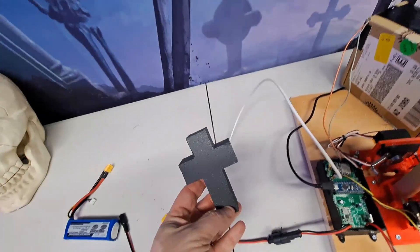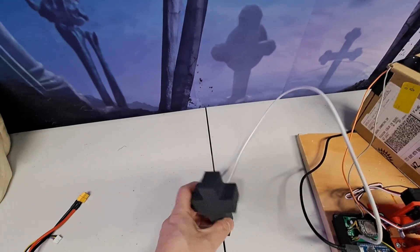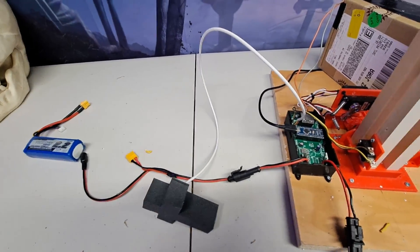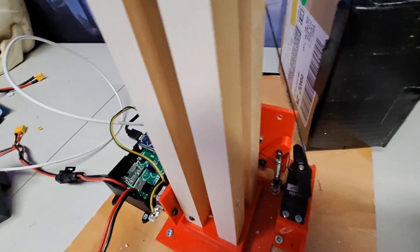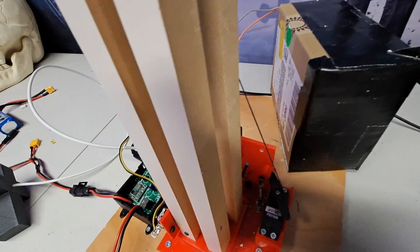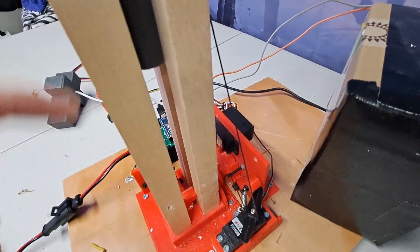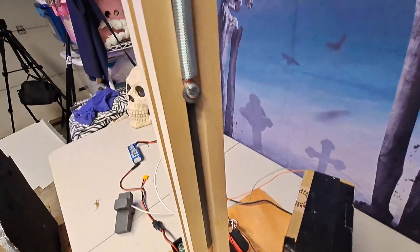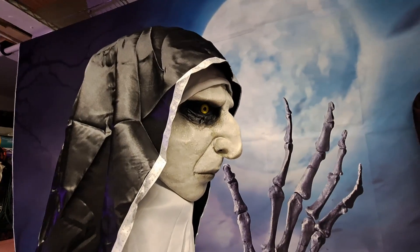I have a trigger housed in a little cross shape — it contains a proximity sensor that uses a radar waveform, a bit like a PIR sensor. Once triggered, this arm moves backwards out of the way of the ratchet, and an extra servo disconnects the pawl. The ratchet is then free to spin, the pulley releases its string, and the springs pull the prop up very rapidly, unwinding the string. Whatever's on top jumps up — if it goes fast enough, it flies off entirely.